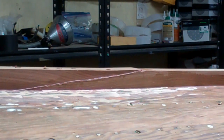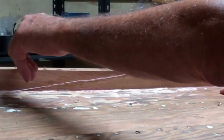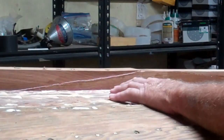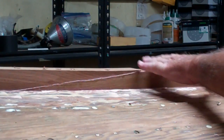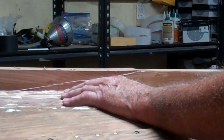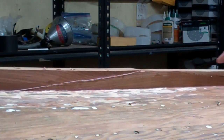Now what we've done in the past, this is an innovation on Joe's part. What we've done in the past is to set these two pieces on a piece of very thick waste plywood and actually do what Joe's done here. We would clamp both sides, but only after we sank an initial screw. Because if you just clamp these, they're going to tend to slide apart. So he applied the 5200 to this face. With Anthony's help, put this guy in place after buttering the faces with 5200. And then he's sunk a series of screws so that this joint is probably stronger than a similar length of wood forward or aft of this scarf.